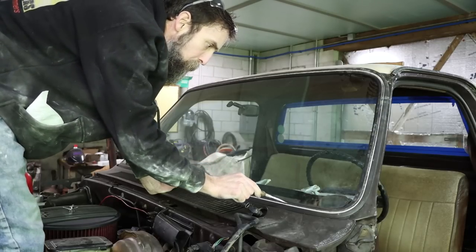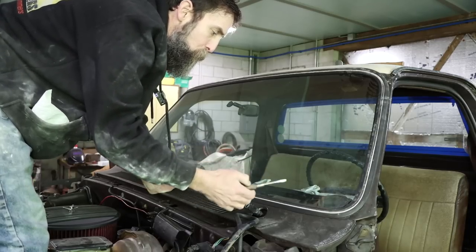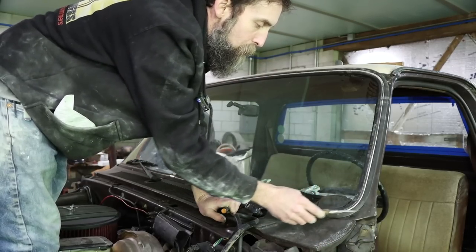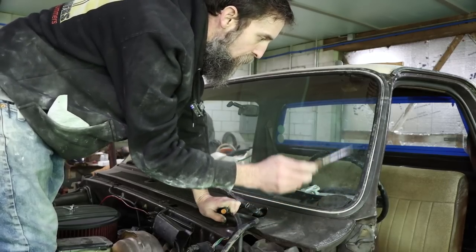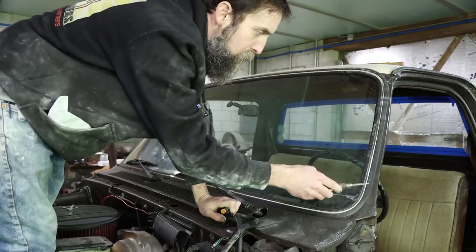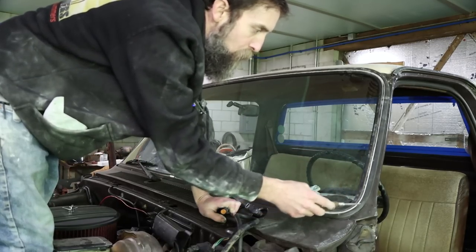Now I'm going to pull out this center locking strip. This is what locks the windshield in. I'm going to pull that out, and then I'm going to take a piece of rope or twine, string, whatever, and shove it up under this gasket. That way when I go to paint this thing, I can get my paint line up and under this windshield gasket, and I'm not having to tape off around this, because a respray on any vehicle with one of these type gaskets always starts chipping out and breaking away and showing damage right around the tape line.